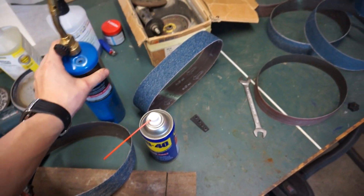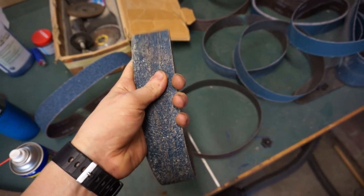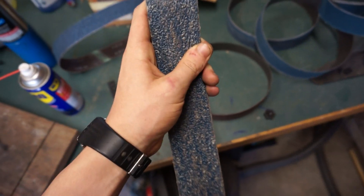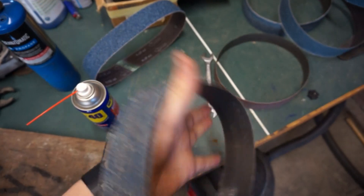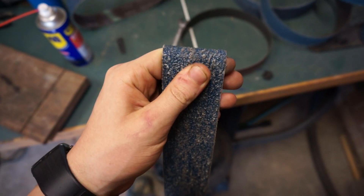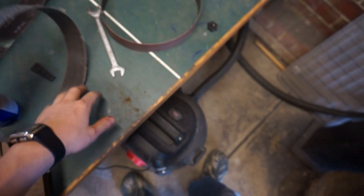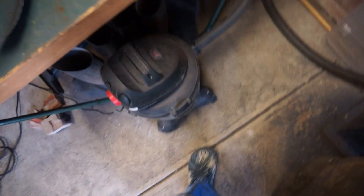WD-40. Torch for anodizing. Belts - I need a few more belts and a better organizational system. This is a pretty worn 24 grit belt. My main belts are 24 grit and 80 grit. 24 grit I mainly use for basic shaping - cutting the shape out of the steel. Sometimes I use a worn 24 grit for very thick bevels. The thing about these 24 grits is I think they're oversized. I paid money for good belts and I'm pretty sure these 24 grits are a bit oversized, which pisses me off because I can't center them and I'm sure they're going to cut me one day.